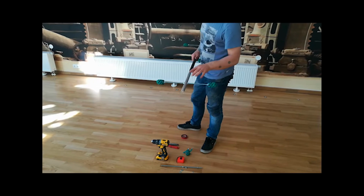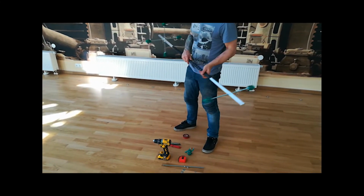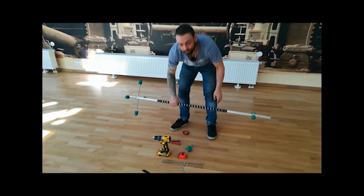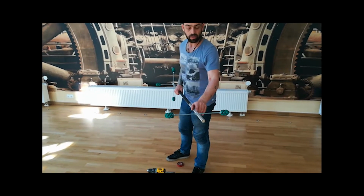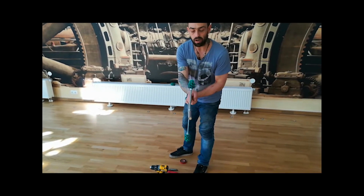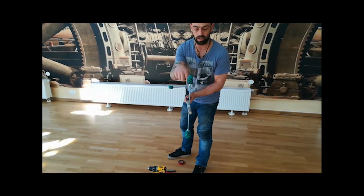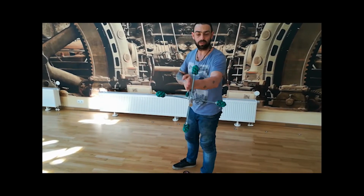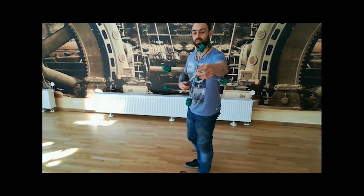Now this does become a problem when you're doing this freehand, because it's very hard to get them to sit flat when you first start doing it. The best way is to do one this way, put a rod in, turn it this way, and eye it up so it works out pretty well square, so you get a nice cross like that. So do the first one, and then drill right through with that one, remembering that the dowel's in there.